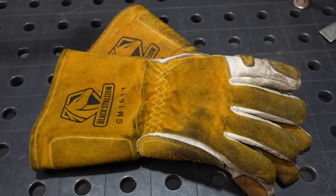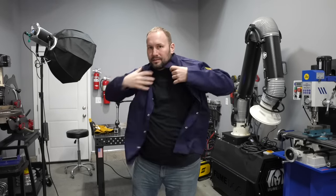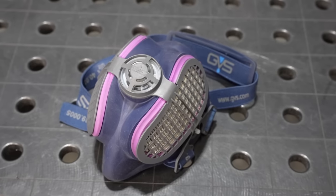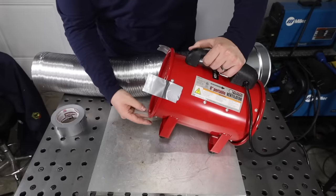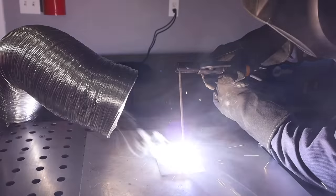Let's run through a few of the other things you're going to need to get started. I'd recommend a good quality auto-darkening welding hood, also welding gloves — good quality leather actual welding gloves. I'd also recommend getting a welding jacket like this; it's a fire-resistant cotton welding jacket, which is a little more breathable and comfortable than a leather jacket. If you're going to be inside or in an enclosed area, it's a good idea to consider wearing a respirator if you don't have a way to deal with the fumes that come off the welding arc, because it does produce quite a bit of fume that can be hazardous to breathe. You can also control fumes with a fume extractor — I have a video about how to make a cheap one for less than $100, linked in the description.